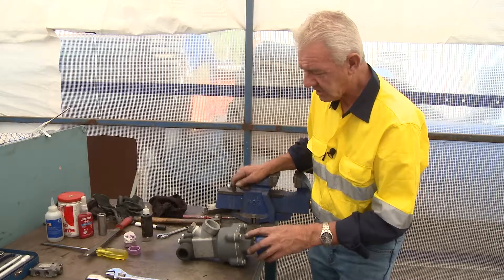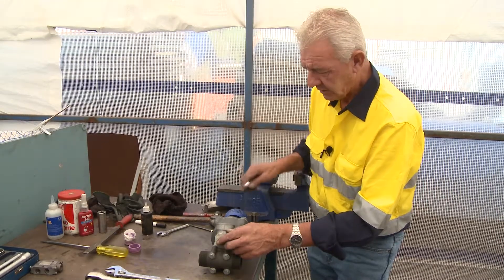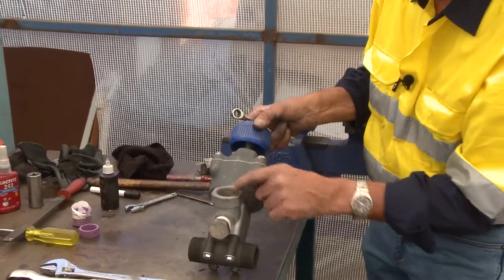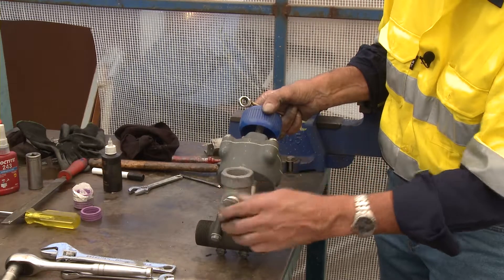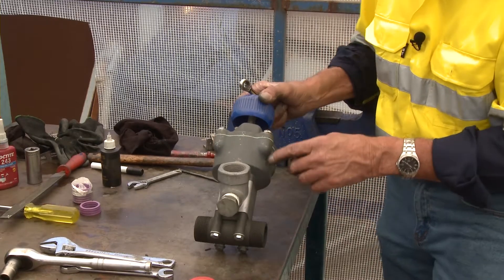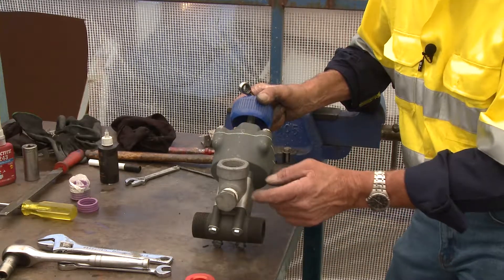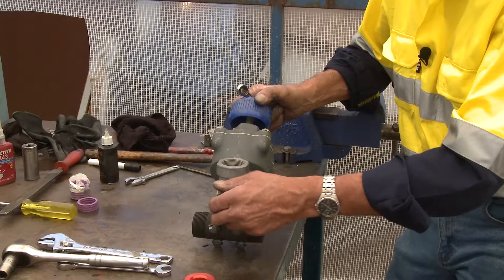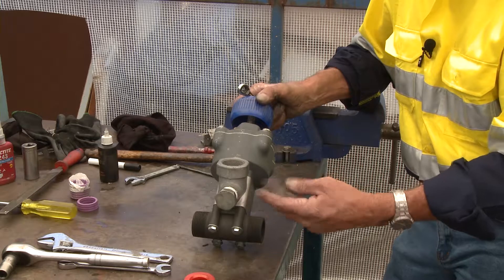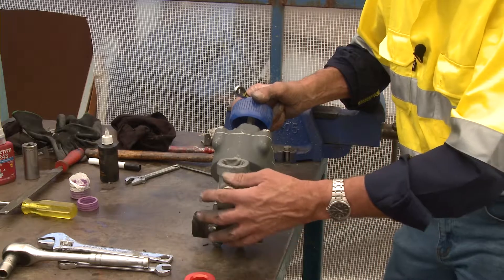So where do I start? I've got base bolts and a big nut here — a plug. Remember, the conical section of the pot comes down here and feeds the grit into this hole. Before I even pull this valve off, I can undo this plug and see if the grit flows through, because if you've got no grit coming through the pusher line, you can use this as an inspection port. Undo this plug and see if there is grit in the chamber — it's a subsequent check as you go through your process of elimination.